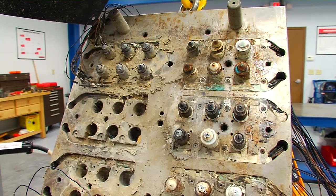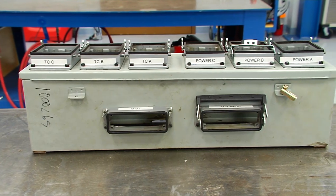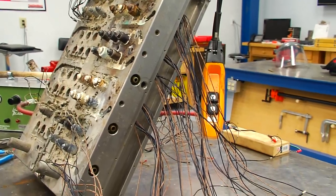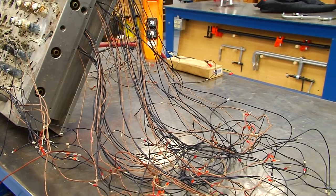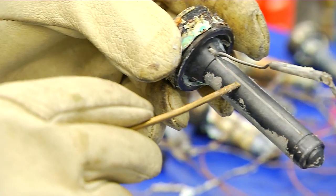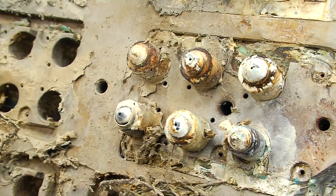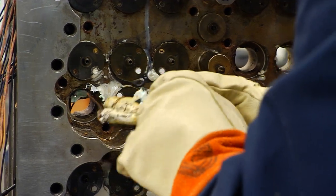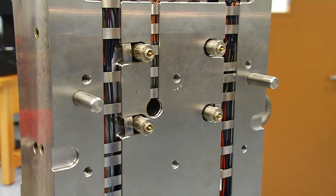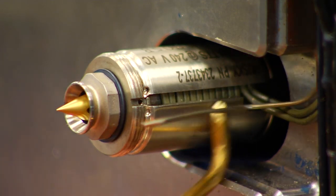Unfortunately, this completely encased the wires in plastic — in this case polypropylene. Several different colors could be seen, so the leak was not detected immediately. Since the mold is going to need a complete tear down, the electric control box, manifolds and bridge have been removed. All wires have been numbered and disconnected so they can be threaded through the wire channels in the plate one at a time. On this mold, the thermocouple wires run along the entire length of the nozzle, making removal from the front impossible, necessitating removal of the nozzle from the back just to get to the thermocouple. On better-designed systems, thermocouples are easily removed from the front of the mold instead of requiring a complete manifold removal just to change out a defective one.